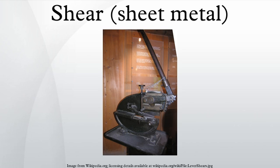As far as equipment is concerned, the machine consists of a shear table, work holding device, upper and lower blades, and a gauging device. The shear table is the part of the machinery that the workpiece rests on while being sheared. The work holding device is used to hold the workpiece in place and keep it from moving or buckling while under stress. The upper and lower blades are the piece of machinery that actually do the cutting, while the gauging device is used to ensure that the workpiece is being cut where it is supposed to be.